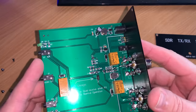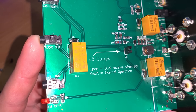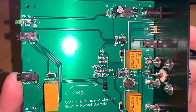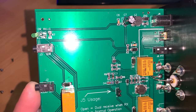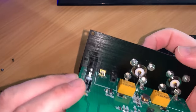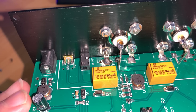Taking a quick look inside, this unit is built extremely well — far better quality than the other SDR switch I reviewed last year. In the middle of the board you'll notice a jumper. This allows the radio to receive as well as the SDR. With the jumper open, both the radio and SDR will be connected to the antenna in receive mode. With the jumper closed, only the SDR will receive and the radio will be disconnected from the antenna in receive mode. When you transmit, the antenna is routed to the radio through the relays and the SDR port is grounded — a very good precaution so your SDR receiver is not damaged while transmitting.